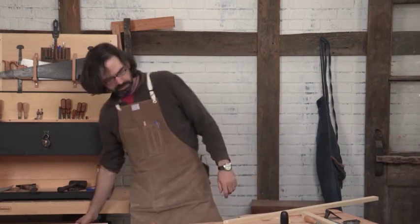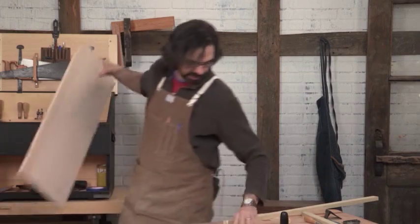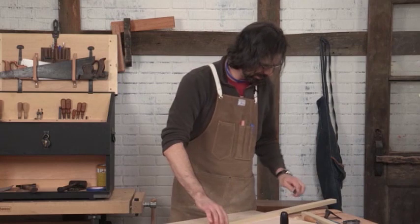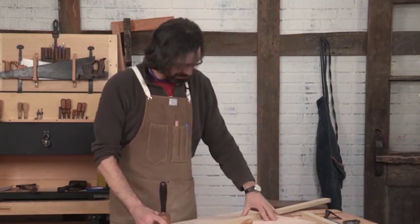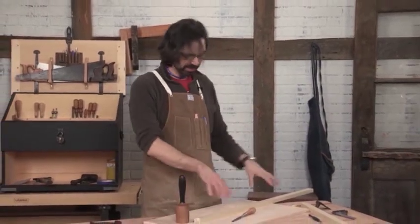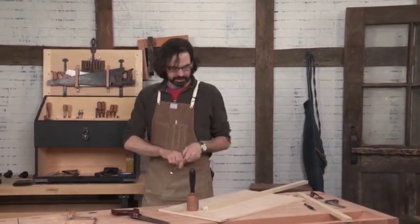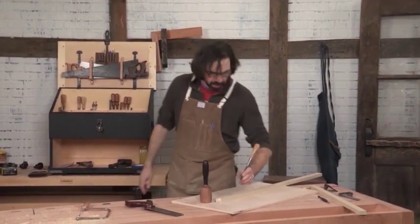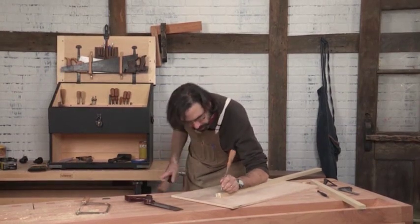And the way you do this is, I don't want to chisel into this really nice bench. And some shops actually charge their employees if they do such a thing. So I don't want to get charged. So I have my chisel, I have my work, and a lot of people take this way too far. They clamp this 10 ways from Sunday. Really, you are a highly effective clamp. And so I'm going to hold the chisel like a pencil, and then I'm going to put my arm on the work, so that's my clamp, and I'm going to chop down.